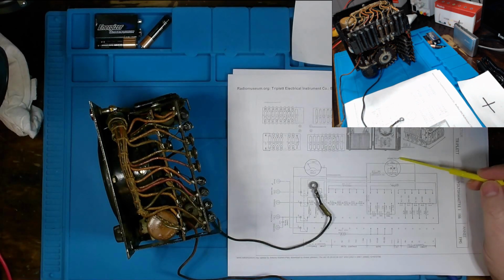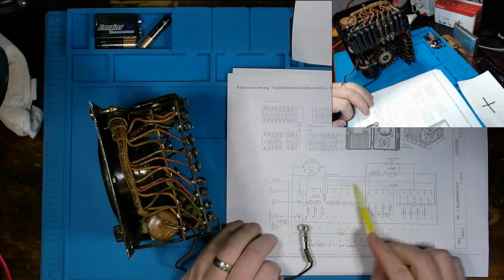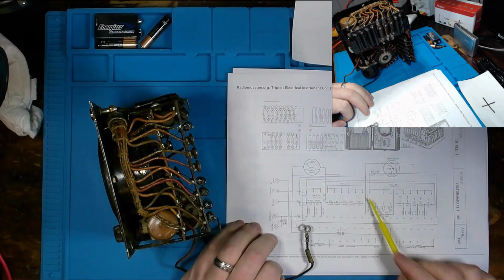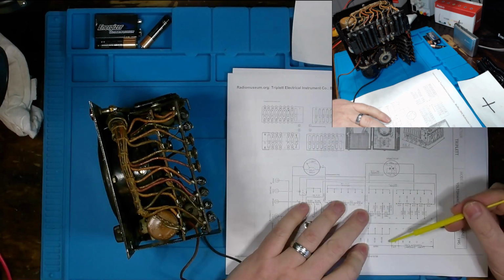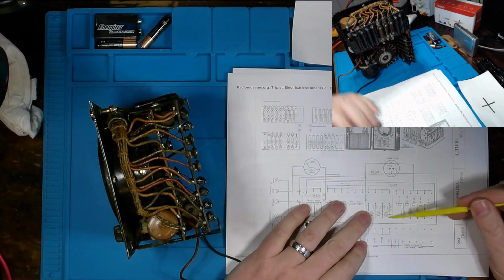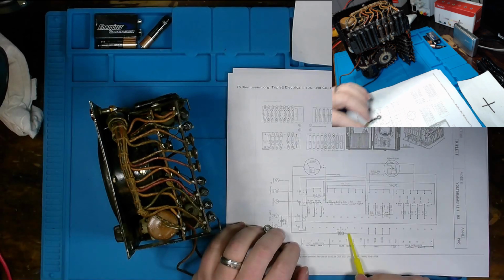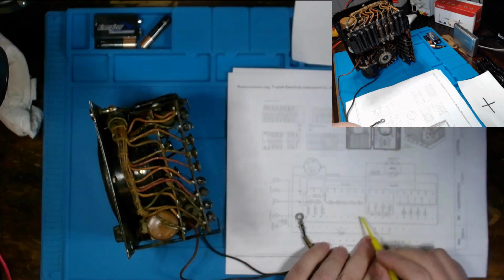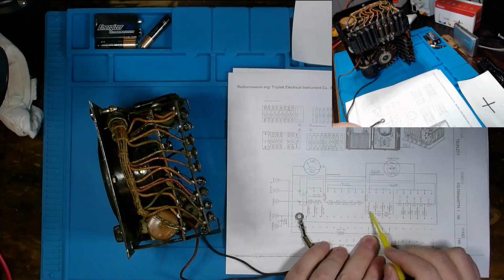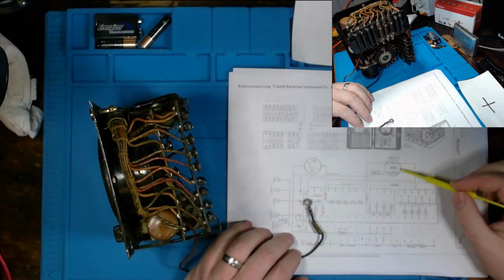This French word that you see here, redressure, or however you pronounce it, actually translates to rectifier, which now makes sense given when we follow our path here. We're essentially in our selector switch down at the bottom of our diagram. It's used in conjunction with a resistive measurement, so we don't have direct battery voltage for that measurement. As the negative lead is tied to one side, our rectifier is supplying a voltage through this resistor network in order to provide us a measurement in resistance.